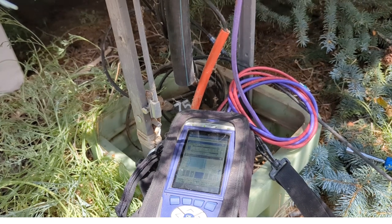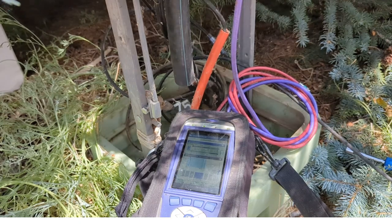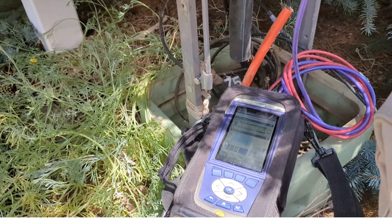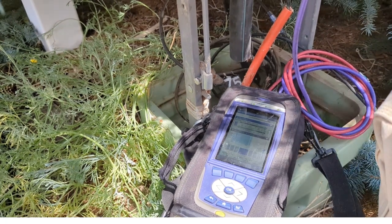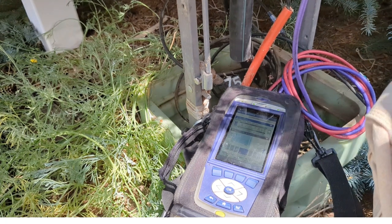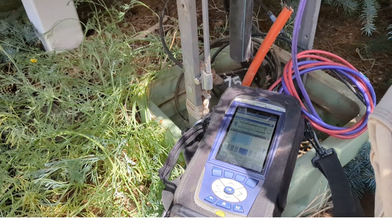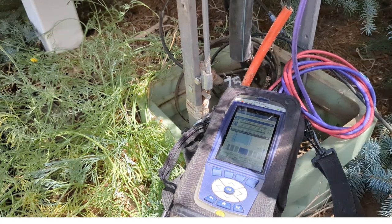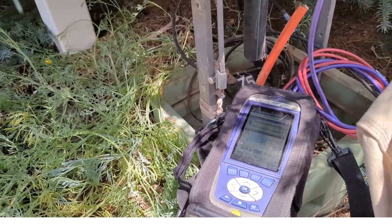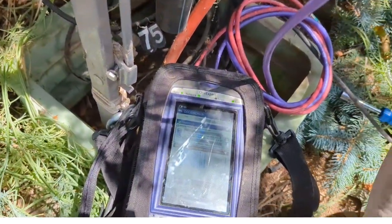Our DOCSIS check ran — everything passed but we're transmitting at 51 dB, so we're going to pad that down. We want to be about 37, so we're going from the 17-pad to like an 8 — let's see what that does. Start it again. We got our level set, everybody looks good. Spectrum is nice and flat, a little bit of tilt, and we're ranging at 41 coming out of this, which isn't awful.